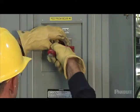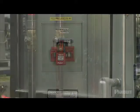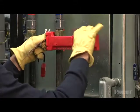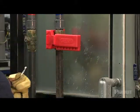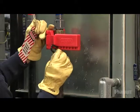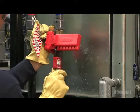The lockout/tagout network is applied to all on and off switches and controls to physically prevent access to them. Use only your own lock to lock out the equipment you are working on, and remember: locks used for lockouts should be used only for lockouts. Don't use lockout locks on tool chests, lockers, or cabinets — use them only for lockouts.